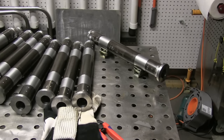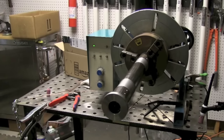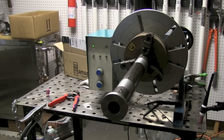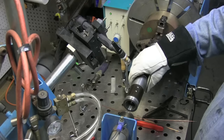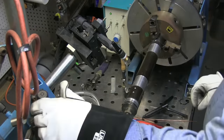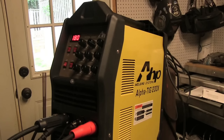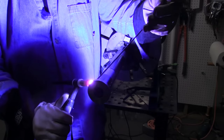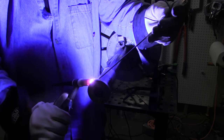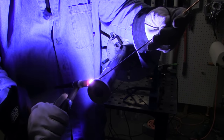They're all tacked now, so I'm going to weld them on a positioner. I bought this thing back around 1996 off eBay. I've actually also got a lathe set up with a tail stock, a torch holder, and a pneumatic actuator, and I'll show that in a future video using a water cooled torch. With this setup I'm just using the positioner — I'm walking the cup on the flange part and lightly propping with a TIG finger on the other joint.